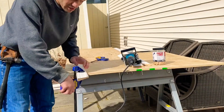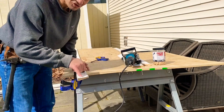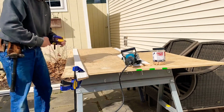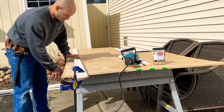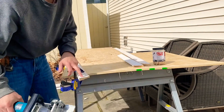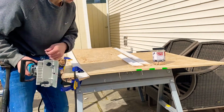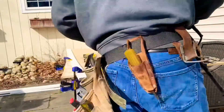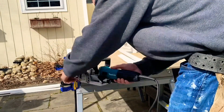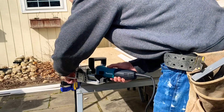I clamped this casement onto the plywood — you want to clamp it tight, as this is a pretty dangerous tool and you want your cut to be precise. I put an extra clamp down here. I get the viewfinder lined up, align my arrow with the pre-made mark, and the depth has already been tested — it's going to work perfect. I turn it on, line up the viewfinder, and do the plunge.